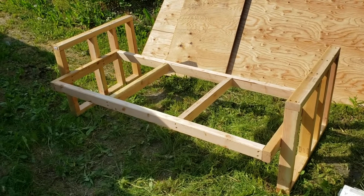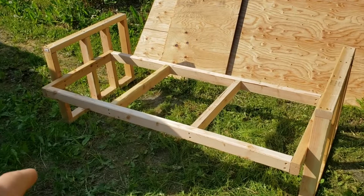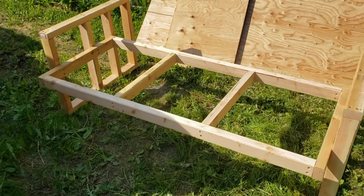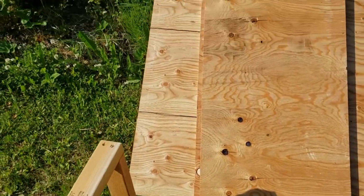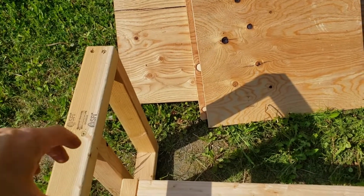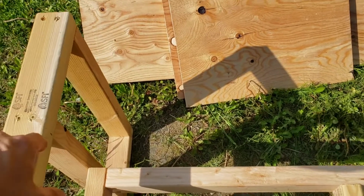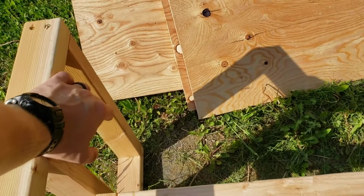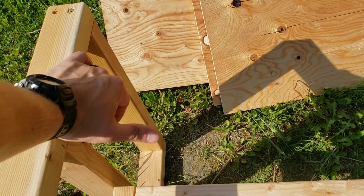Okay, so here's the start to the frame for the sofa, and I'm going to put some more supports underneath, but just to explain what's going on here. So the frame for the rest of the bed, I'll rip it out of plywood. This is 9 inches, and it'll go down there, fastened to this, and then the Lazy Susan bearings will mount onto that.